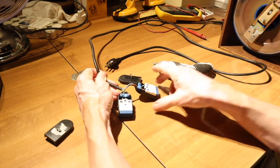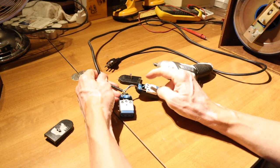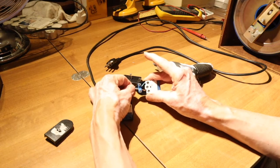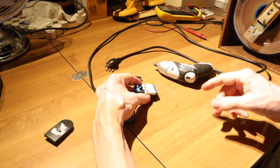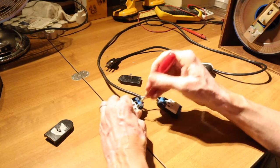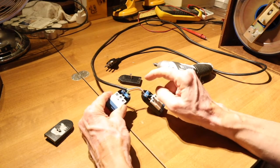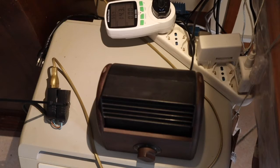That's how you build this. You have to take care that all the connections are good, that these clamps are well done and well connected, so that if you pull here it will not pull elsewhere. Always check that these connections are really well done. In this case the earth connection is going only to one — it would be more correct to connect it to both. So this is the situation with the fan in the lowest speed.